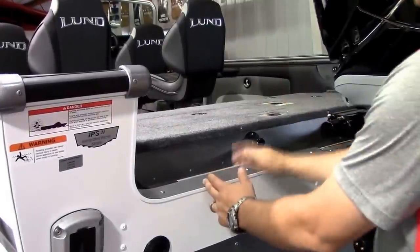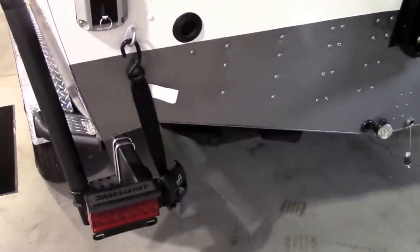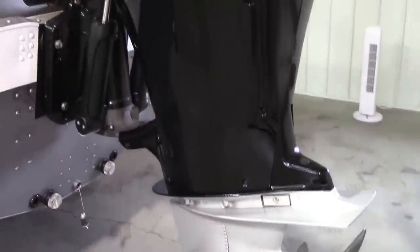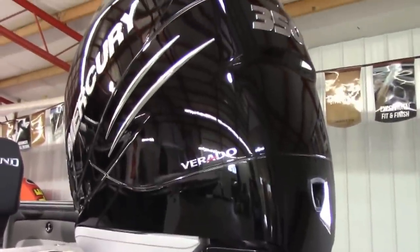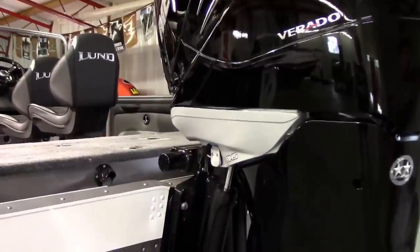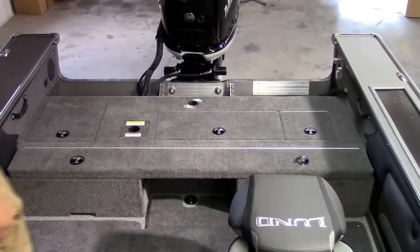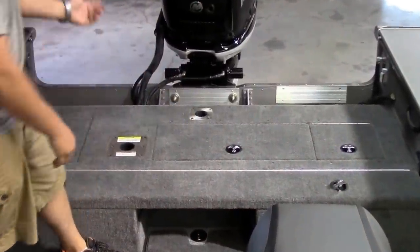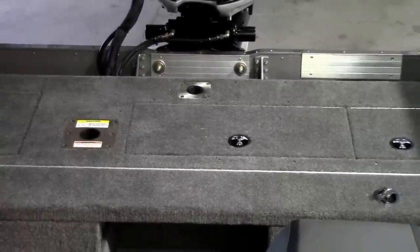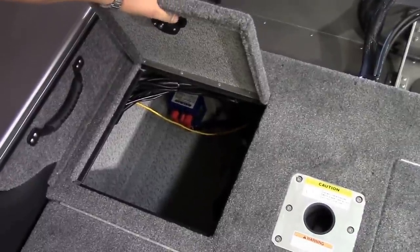If you want to put a kicker on it, all we have to do is set it on there and plug it in — it's really easy. Most guys behind this boat are going to want a kicker motor anyway. It's easier for us to have Lund do it because of all the extra components that come with it for that power steering pump to work. Most guys are going to want to put a 15 horsepower kicker on this as well, because the 9.9s don't charge back to the battery near as much as the 15 does — if you put a 9.9 on here, eventually you're going to run the batteries weak. Getting inside the boat and starting at the back, you'll see the fixture for the ski tow pylon. The hardware is already standardly installed from Lund on these boats; the pylon doesn't come with it, but if you want it, all we have to do is order it and it drops right in place. Over on the starboard side there's a large compartment where they put the power steering pump, but there's still a lot of room around that to put whatever you want.